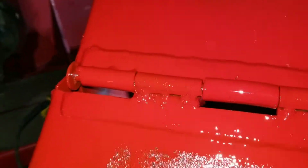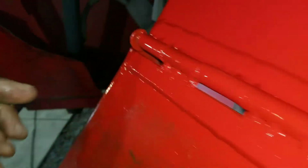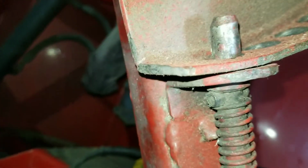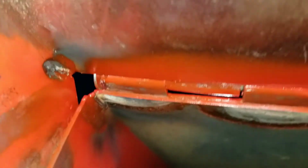Okay, so it got dark on me, so I was rushing through this, but it all worked out very well. I put 3 tacks in each one of these to kind of keep them from unrolling in the future. I put a new 3/8 of an inch pin in there, welded a washer on that side and a cotter pin there. It's good that way. The fitment is good, and everything looks good under there. So that'll about do it for this one.